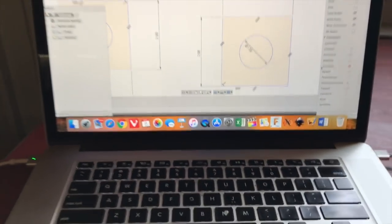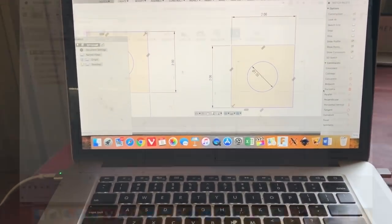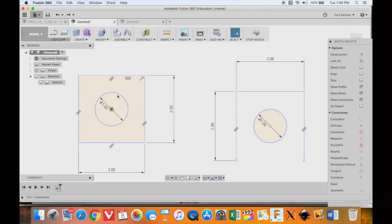Check this out in Fusion — let me bring you in close. Here we are inside Fusion 360. Here's a look at the two different versions of the part we're going to cut. The basic difference is the part on the left is completely closed in at the exact dimension, and we're going to offset that in the CAM. The part where we use the edge — you can see the edge is not closed up here. We've offset this in the CAD because it's an open contour and you can't offset in CAM.